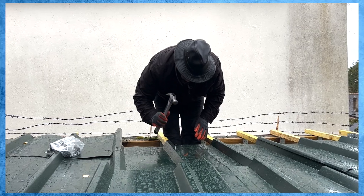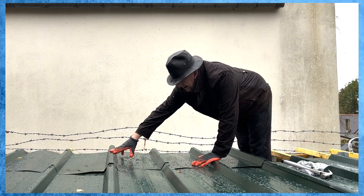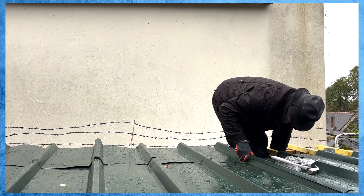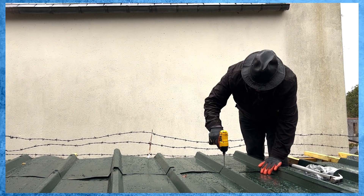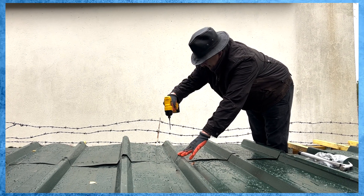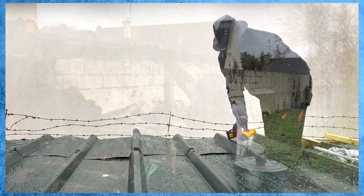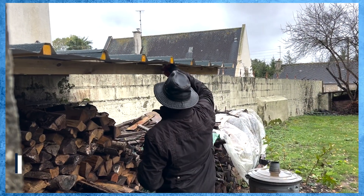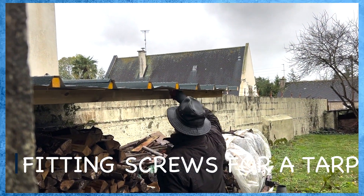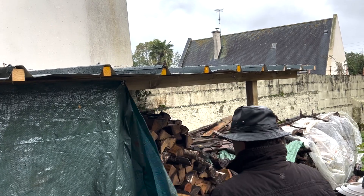It's a bit wet! The roofing is sheet metal and it was easier to put a few pilot holes into the metal before hammering it into the wood. Then finally we put a tarpaulin across the front — it needs to be a tarpaulin so it can be lifted up and down, and we keep the air flowing through the wood as it dries, so you can't put on a full solid front or door.